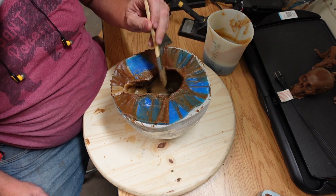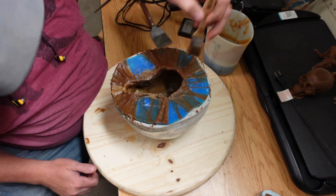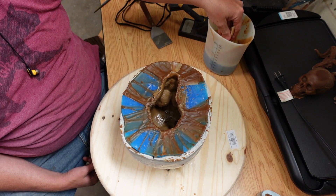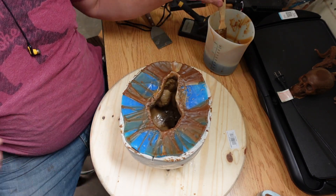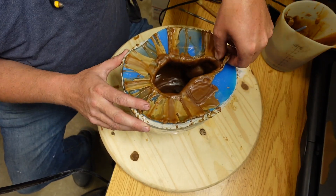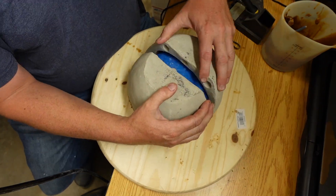I don't like the wax that a lot of foundries use and jewelry people use to make their jewelry — it's just too rigid and brittle. I don't like the brittle of the red and blue waxes. I use this microcrystalline wax and you can find it online — I'll see if I can find a good source for you guys.